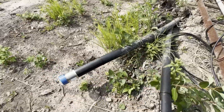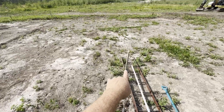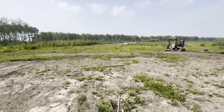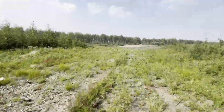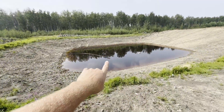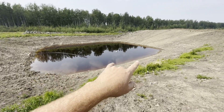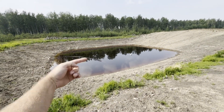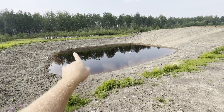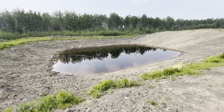So there we are — directional drilling. That's a water line and that's an aeration line. You can see all the way over to there is where we ran them. There they are, coming out. This is going to be our water source. One is obviously the intake line to suck the water, and the secondary one — the air line — is to aerate the dugout to keep the water fresh during the winter.